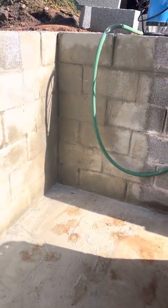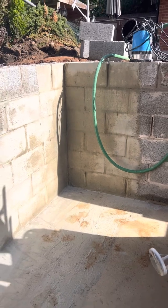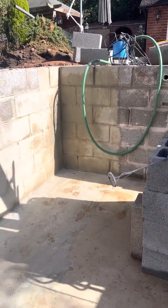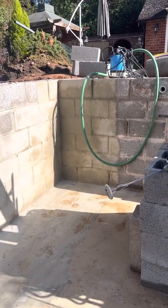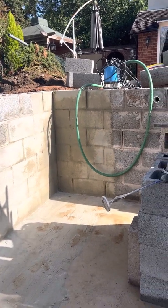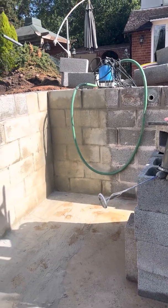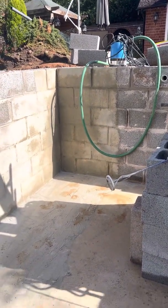In this section I'm actually going to build the steps. Strictly speaking I didn't really need to tank this section because the step is not going to be mainly touching the water, but I just wanted to be sure in case there are small cracks between where the step will be and the wall — so what is behind it will be completely waterproof.